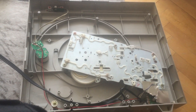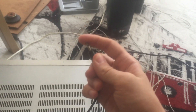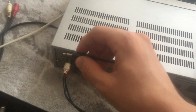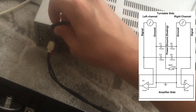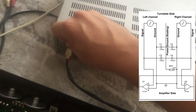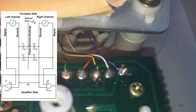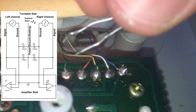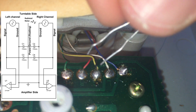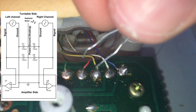So we identified the problem — but what is the solution? An obvious solution is to connect this wire to somewhere to stop it from floating and picking up noise. Here, check out what happens if I connect this cable to the amplifier's ground. Here you can see the PCB on the turntable. The two lines on the right are the left channel's ground and the left channel, and these two wires are the right ground and the right channel.